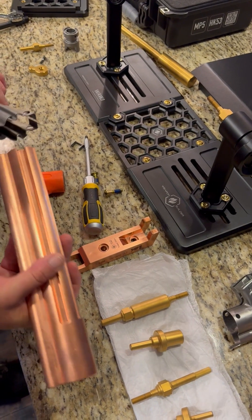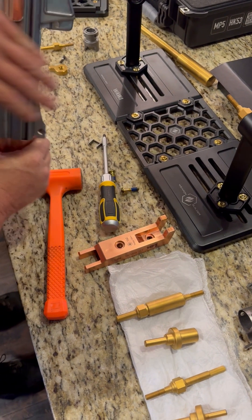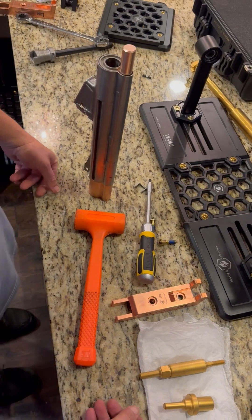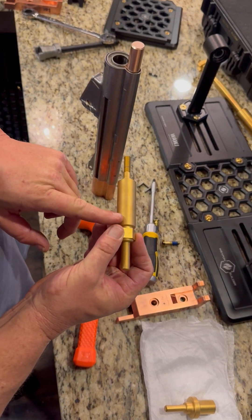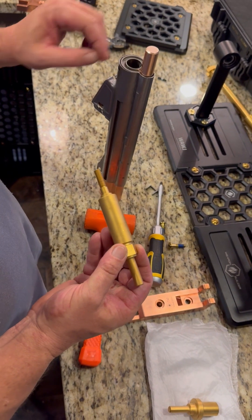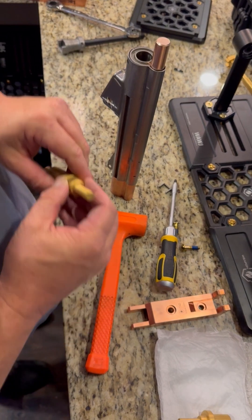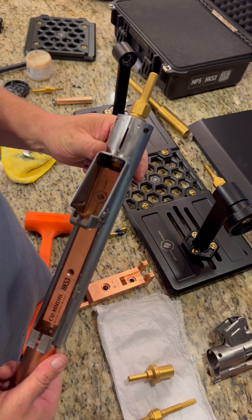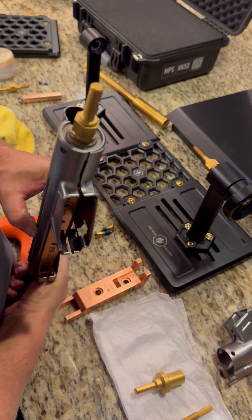The full-length copper mandrel — you insert it in reverse into the rear, and then for here we would have our trunnion. Then you take this spindle here, which is a through-trunnion support. It goes through the trunnion and interfaces with the mandrel itself, providing it completely locked in. Because the mandrel is locked into the rails, it will now lock this in at a completely parallel path. It goes straight through the receiver into the mandrel, aligning the trunnion with the receiver rails themselves.